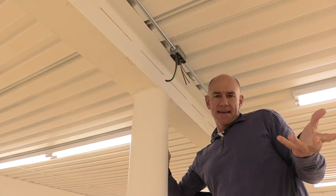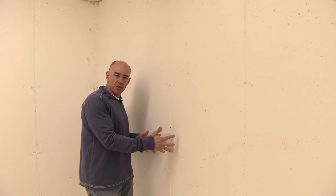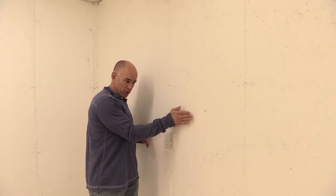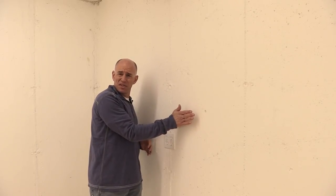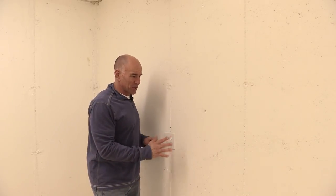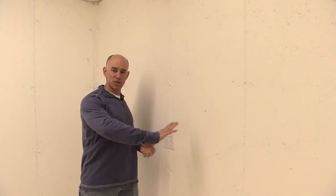When I got to the 120-volt work, I decided to take a step back. One of my outlet boxes for 120 is in this wall, and there's going to be a closet here - this box will be on the outside. I've planned a wall treatment that's going to look cool and also insulate a bit, which will build the walls out about two inches. All the 120-volt wiring is going to be run with surface-mount conduit, so until I have a surface to mount it to, there's not a lot I can do. I'm going to take a break from electrical, work on the walls, frame out the closet, and then come back to finish the electrical. The next video will be framing and insulating - see you next time!